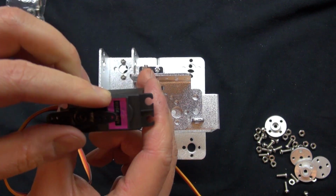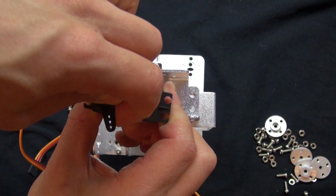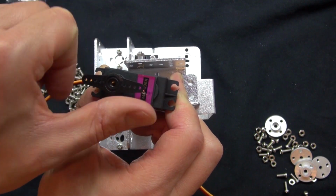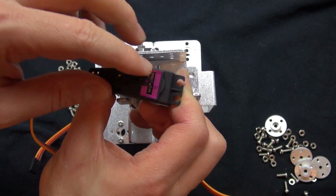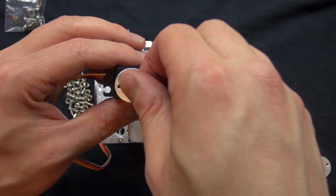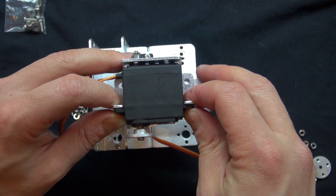Now it's time to take your second servo and pre-align it just like before. Rotate it this time all the way anti-clockwise, just like that. Pull this little lever out, position it like that, and go clockwise, and align it just like that. You can see that it goes a perfect 180 degrees. So follow it carefully, and set it in a 90-degree angle, and that way this can rotate both directions 180 degrees comfortably.